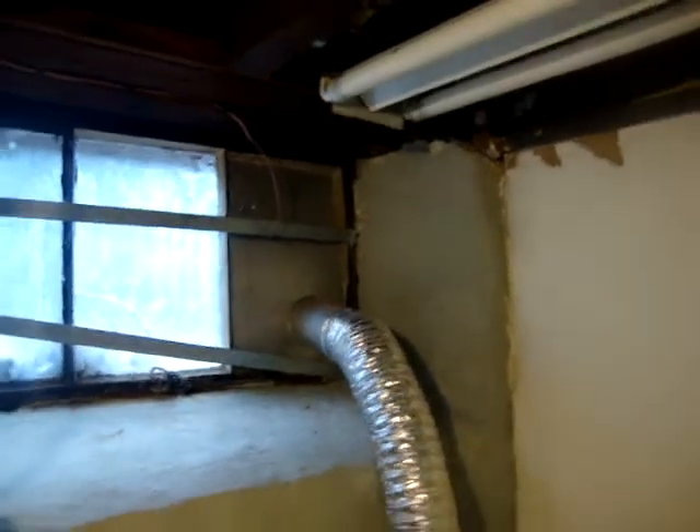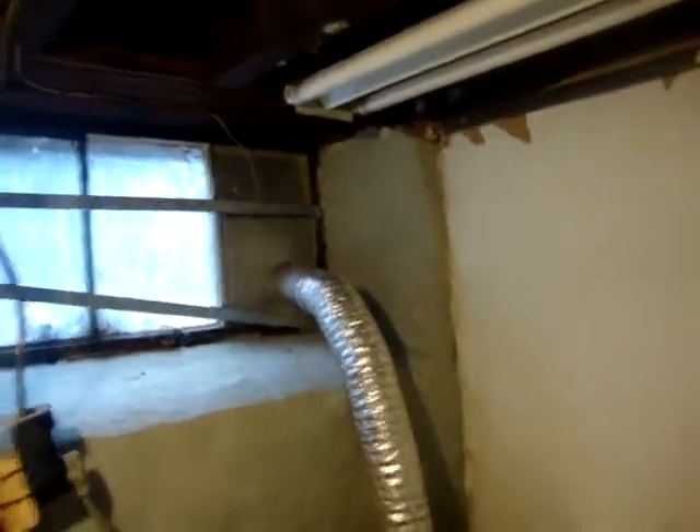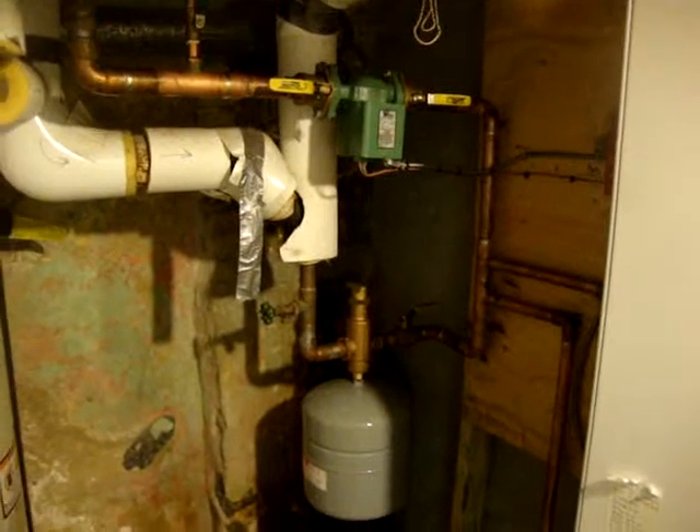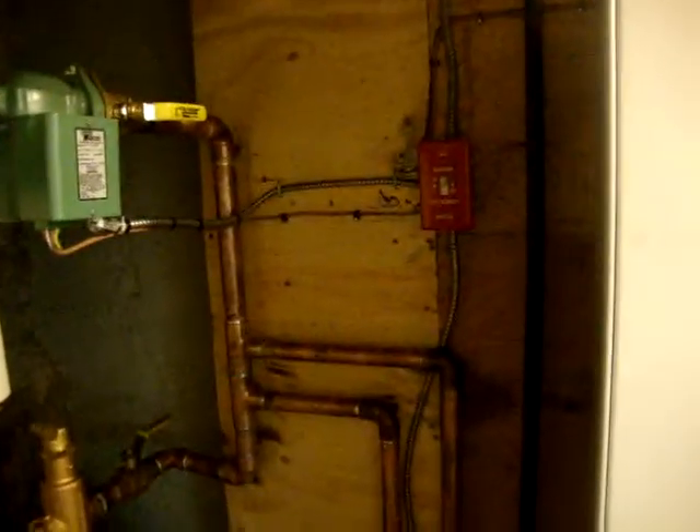He also set my design temperatures drastically different. He hooked the outdoor temperature sensor right above the dryer vent — that's got to move. That was probably just a temporary fix. But he got all this done in a single day: removed the old boiler and oil tank and got this system in on a cold day when I was out of town and my wife was home with the kids.